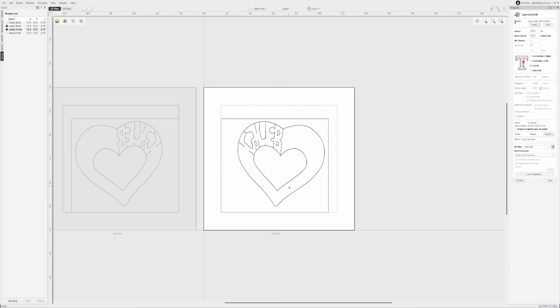So that's really the process, is create the frame that's your reference, and then mirror image the design and go from the left side to the right side, so that the one edge of the wood is referenced to the design in each case. And that's all there is to it. When I did this, I got very good alignment. You could see a slight bump. Some of that's due to the laser beam spreading out and not being perfectly aligned in the middle.